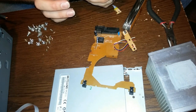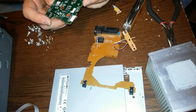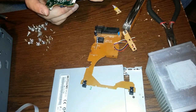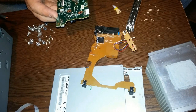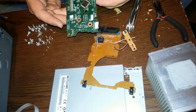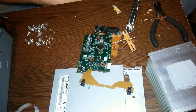If I get lucky, it'll be right here. There's a small gap there where one pin's not being used. So if it's on one of those, it'll be perfect. Actually, I'm just going to follow it now. And let's see. So the second one up. And I am lucky. It is right there on the edge. Alright. So, we'll just power this up and give it a shot later. And then we're going to go from there. We'll make a hybrid CD-ROM and floppy drive.